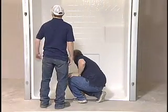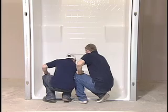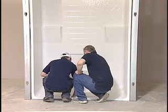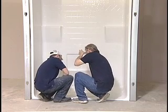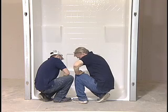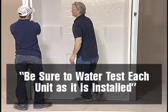For all jobs, but particularly large jobs, it is recommended that one unit be installed with all potential installers present. The installers can be trained and coached on proper installation methods. After 72 hours, once the braces are removed, bring everyone together again. Review the outcome — the feel of the floor with draft, no bulges, and a solid foundation. Discuss the steps again and send the team forth for successful installs throughout the remainder of the project.